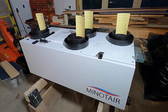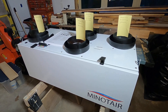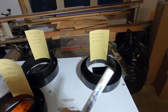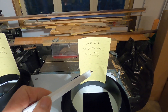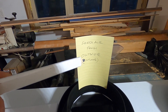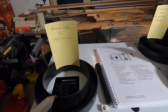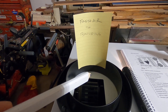Let's check out my new heat recovery ventilation system, or HRV. You'll notice first off that there are four ductwork ports on the top of this thing. We've got stale air going outside through the wall, fresh air coming in from outside through the wall, stale air from the building — primarily from the bathrooms — and fresh air back into the building.